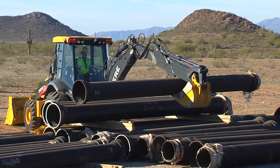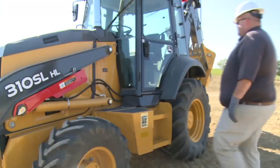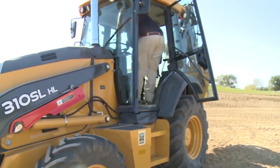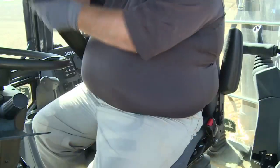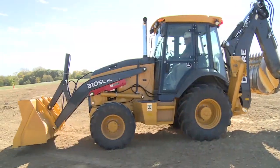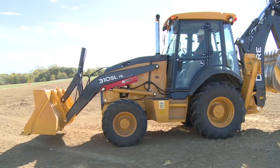The design of the John Deere L-Series backhoe reflects a lot of consideration for safety, but this does not automatically ensure safety on the job site. There are many pieces of safety equipment on the backhoe loader, but there is no assurance that the safety equipment will get the job done unless you use it. One of the most important pieces is your seat belt — buckle up before you start the engine. The rollover protective structure by itself does not assure your safety in the event of an overturn; if you are not wearing your seat belt, you could be thrown and crushed. Don't operate under the mistaken impression that if a machine overturns you can hold on or jump free — that impression may be fatal. Before starting out, make a quick check of the operational controls.